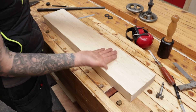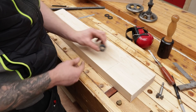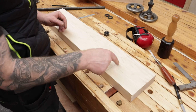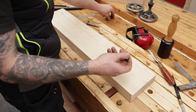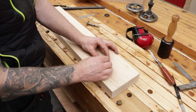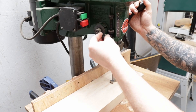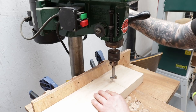Our next job is to drill the back jaws. We want to set the nut into the front face of the back jaw. I'm going to drill with a 25mm bit first to the depth of the nut, then finish the hole through with the 20mm bit. Then I'll mark out the nut profile, chisel it in, and set it into the face. On the back of the Moxon vise we'll have a washer and a lock nut to lock the thread in place.